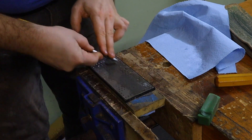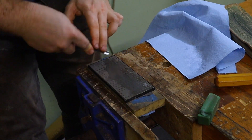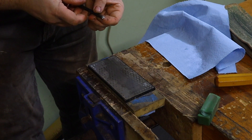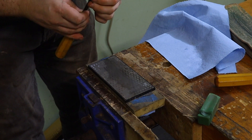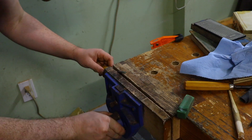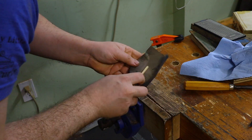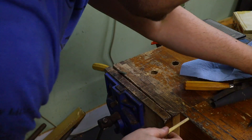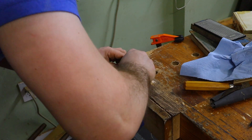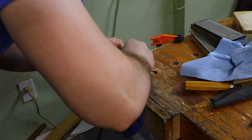From what I heard in another YouTube video, you need to focus more on the sides of the curve, while the middle part, as it has the most contact with the surface, will get sharpened as a result. As soon as I felt a burr on the inside part of the gouge, it means the first step of sharpening is done and I need to refine the edge on the finer stones. However, I cheat by removing the burr using fine sandpaper — 1000 and then 2000 grit — and a tiny dowel. I do it every time I sharpen the outside bevel.